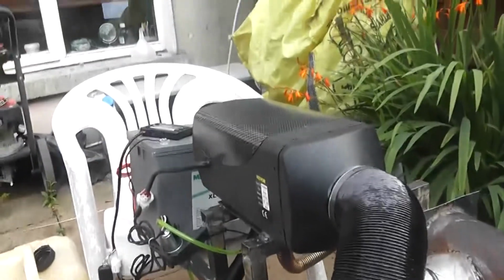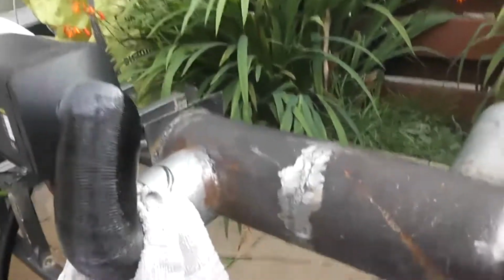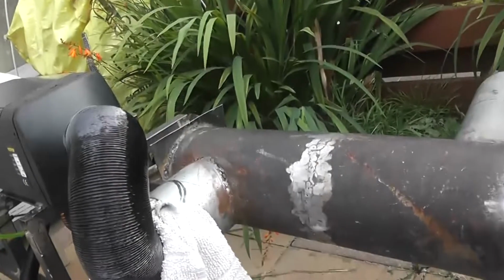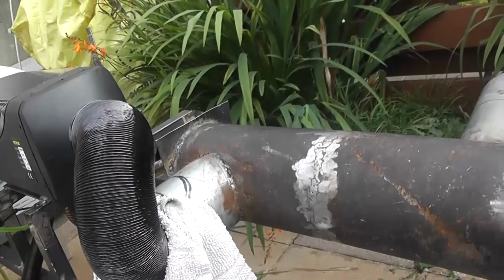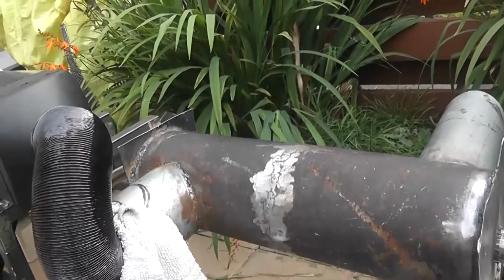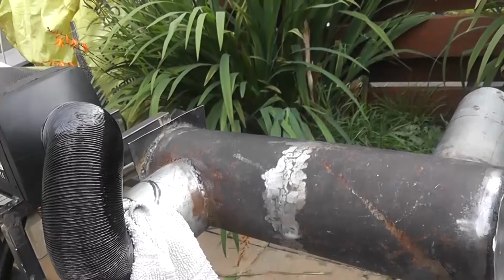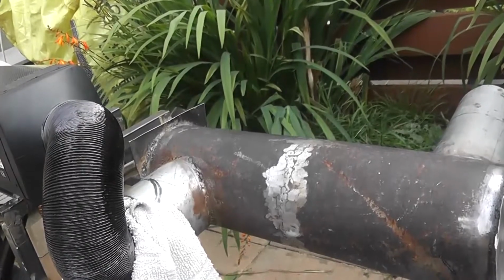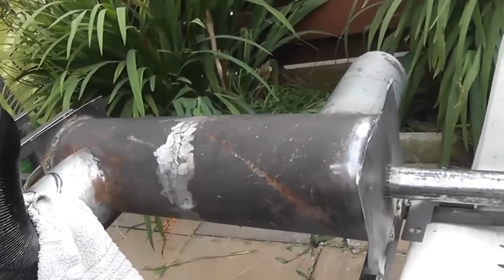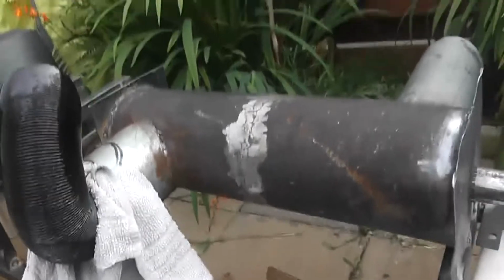So if I work out the airflow from that pump, it might actually be written somewhere on the specs. If I could double the airflow with a secondary air pump and introduce it into the pipe, making sure there's no back pressure, then that would increase the whole system performance, and it would extract all the potential energy in the heat of that steel.